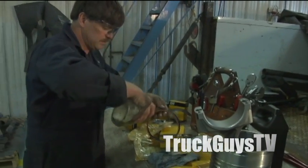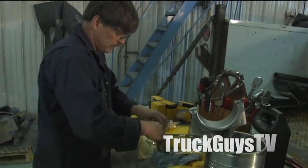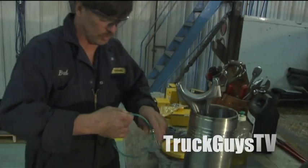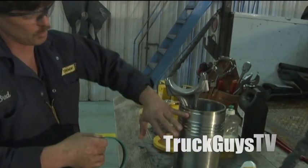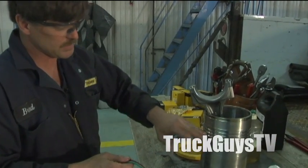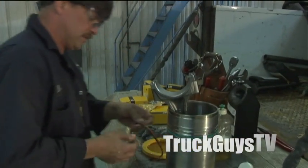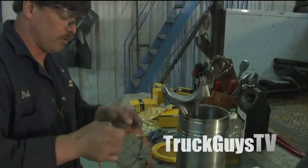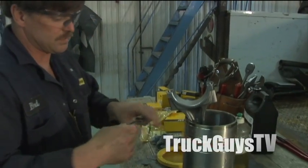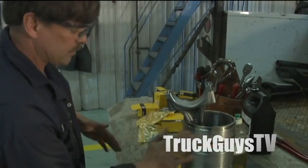It's soap for the O-rings and oil for the top ring, and they have to go in a certain order because there's coolant here and there's oil here, so you have to have the right O-ring according to what it is adjacent to. So this would be the top O-ring against the coolant, this would be the middle O-ring, and this is the O-ring that's against the oil side of the liner. That's why they're different colors.